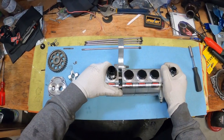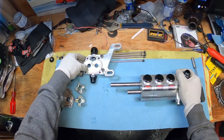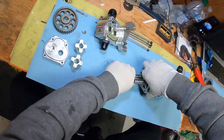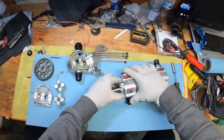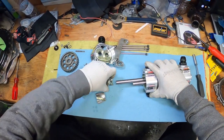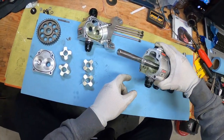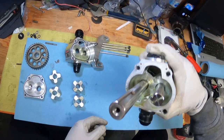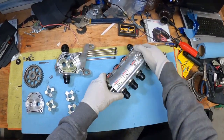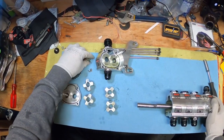I'll show you on the other gears, so let's do it stage by stage — don't forget these little pins, you don't want to lose them. The gear comes out and I put them in the same order. Now you notice that when you take the gear out there are these little keyways that fall out — there, you see those little keyways that fall out. Put those aside.